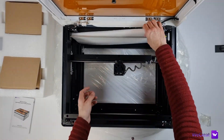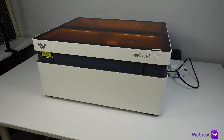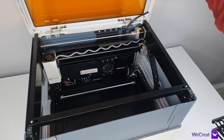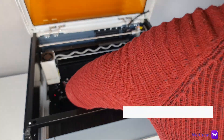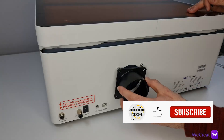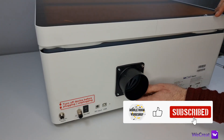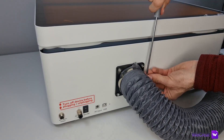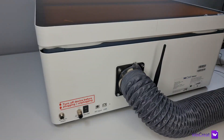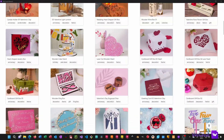To install the bed, you will need to power the machine for the first time so that it rises up out of transport mode and clears the space for it. The connections are located on the back side where you have power, data, air and extraction, except for the rotary connection which is located on the inside. It takes no more than 10 minutes to open the box, install the software and launch your first project. And if you're wondering about your first project, you will be welcomed in the MakeIT app with many free projects ready to go.